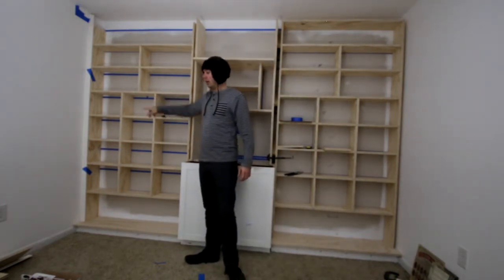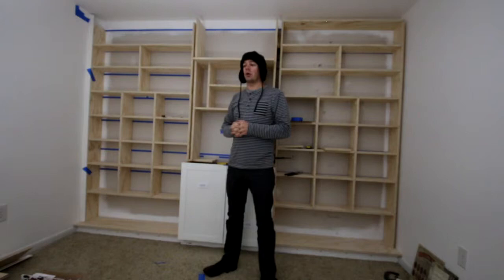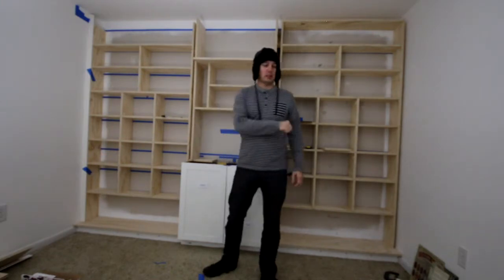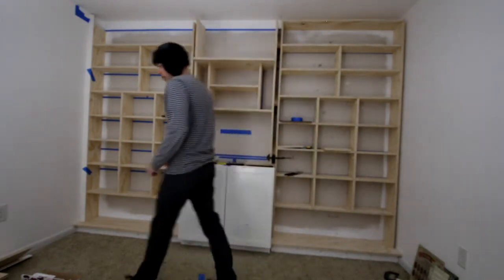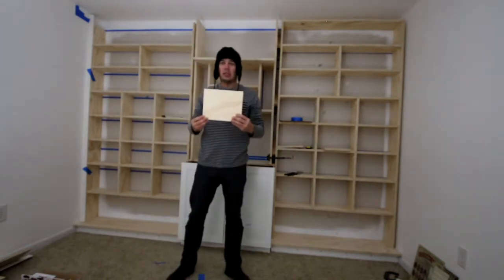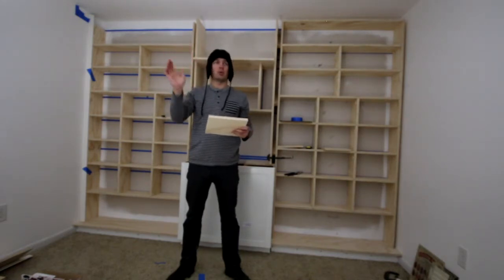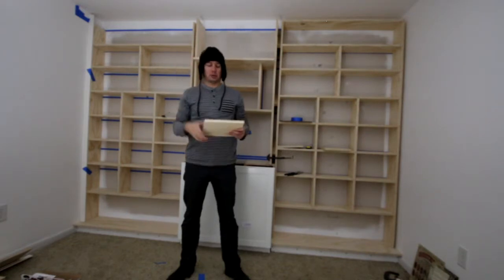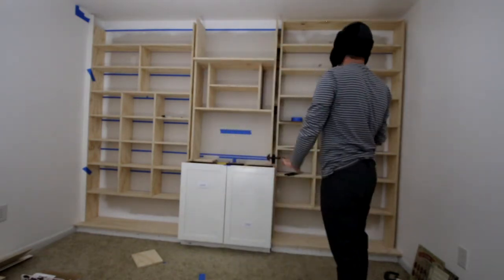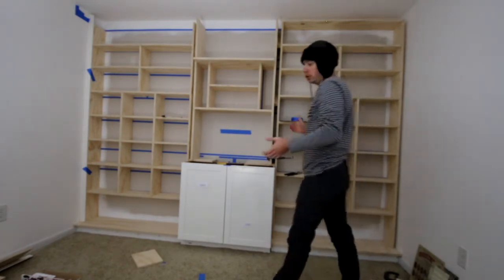And what happened was I got a 1x4 maybe, or 1x3 red oak hardwood. And at the store, you know, I lined it up, it looked very straight. And I get home and I start ripping boards like crazy, and then I start to go cut the little pieces up. And before I knew it, I realized that they weren't completely square. The board, maybe 2/3 of it was really straight, or maybe 3/4 of it, and at the end it just kind of took a little bow. And so it quickly became evident that some of the wood was crooked. And so I couldn't use any of that, so I got rid of all that.